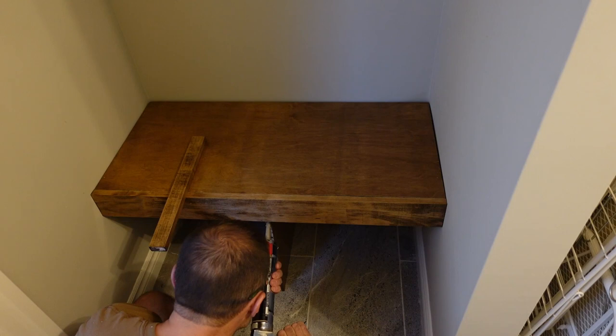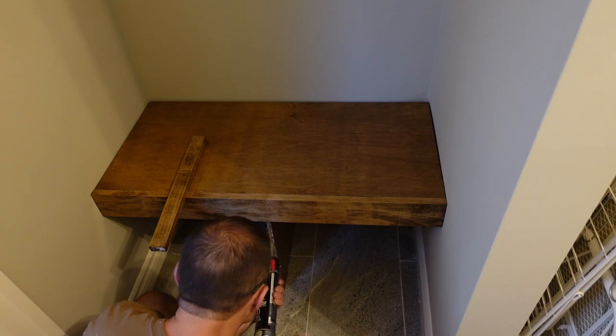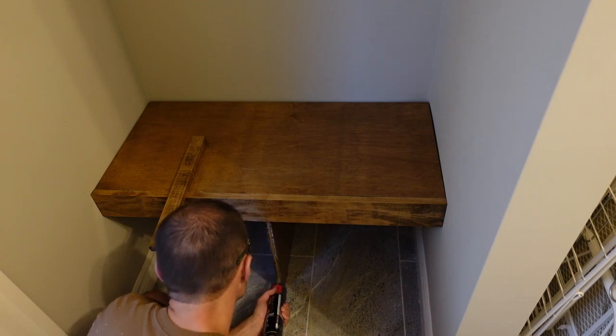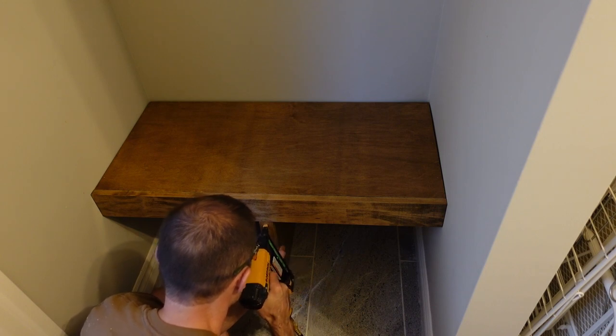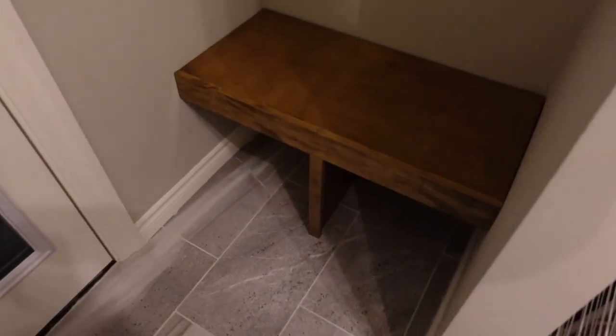Just to cover the plywood edge, I'm using that one-inch board — construction adhesive, put the board in, and then brad nails. Really tiny nails, you can hardly see them once they're in place. That's the bench pretty much done. How I secured the divider so it wouldn't be floppy is by using angle brackets from Home Depot — screwed them into the bottom and tops. In the end, I used about six of them to secure the divider to the bench seat.